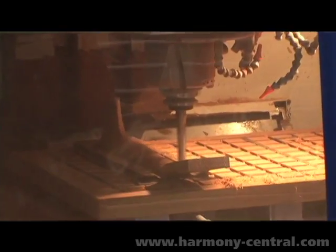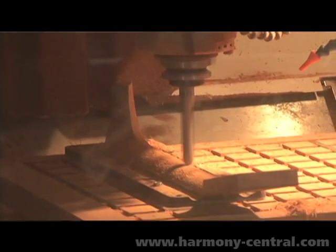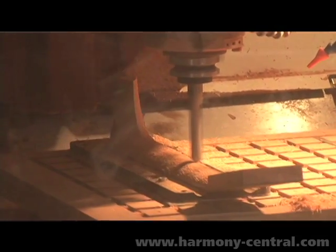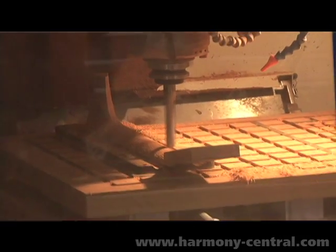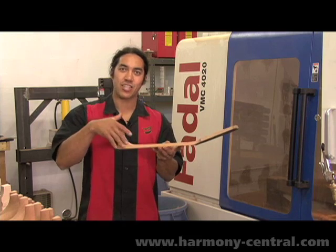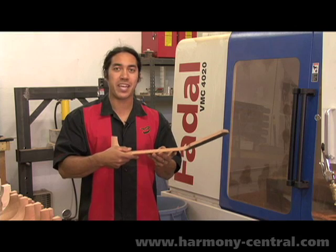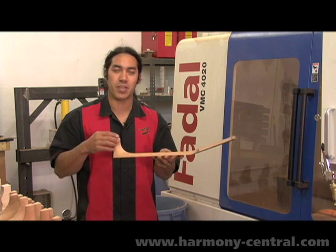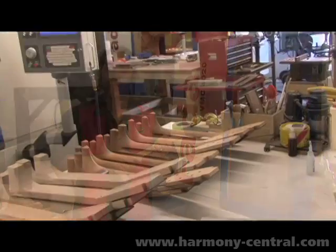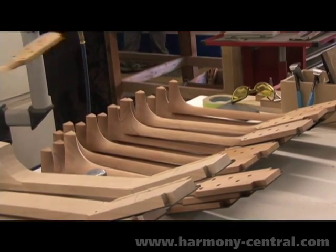And it's very different than just drawing something on the computer and putting it on the machine. The type of neck that you feel doesn't feel necessarily like a handmade neck when you draw it in CAD space, as opposed to what we do when we're reverse engineering, where we're actually taking a handmade neck and tracing 1,000 or more points off of the surface of that neck to recreate the shape of the handmade neck on the CNC. It's actually a much more complicated and time-consuming process to reverse engineer something, but I think the results are worth it. I hope you can feel that when you pick up a Breedlove guitar, that it really does represent the culmination of artistry as well as mass production high technology.